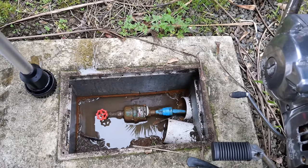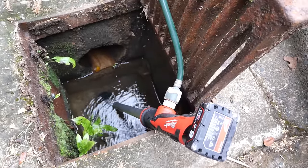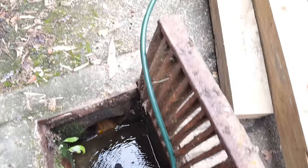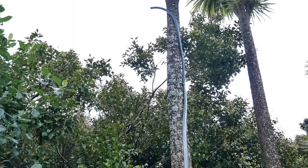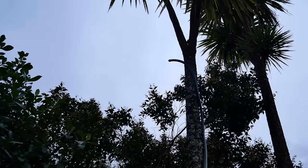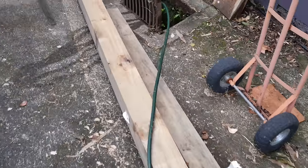Now we're going to test the head of this thing — which is basically how high you can pump stuff. I've got a bit of hose on here and it's 10 metres long. It goes along here and then starts going up, and it is 3.5 metres up this tree. So if I turn that on and water comes shooting out of there, I'm going to be happy — it will do everything I need it to do. That will be quite impressive from such a tiny little 12 volt tool.